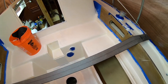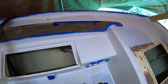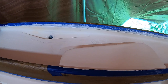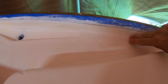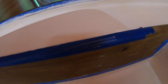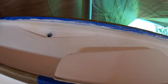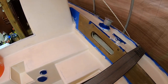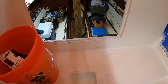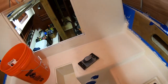This is the day after the one coat of prime coat. What I was talking about when I said it looks like all the cracks — in the previous video I showed right along here other little crazing type cracks, hairline cracks. It really filled everything in pretty well, so I think I'm just gonna stay with the one coat. It says to sand it with 110 grit — I'm just gonna hand sand it.